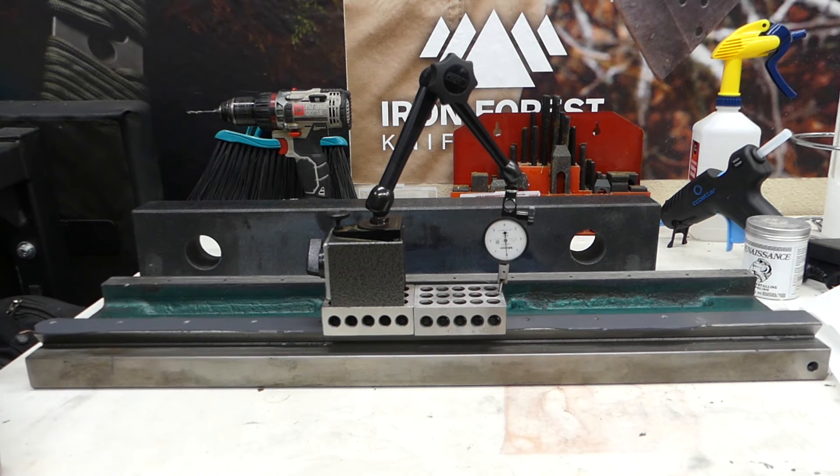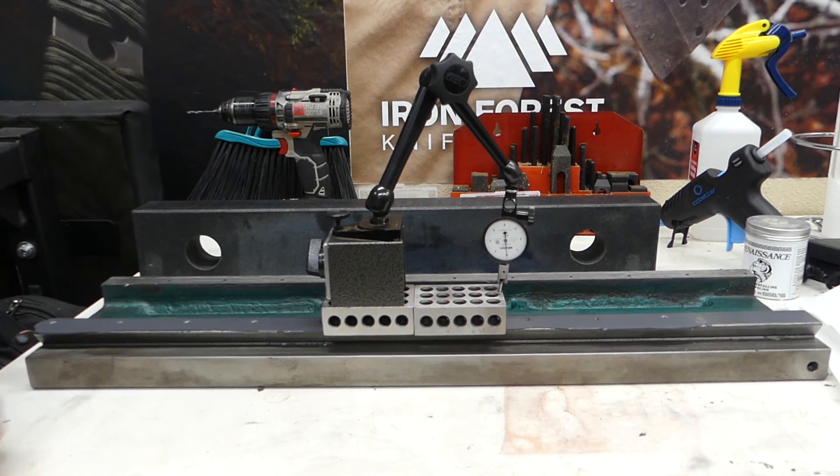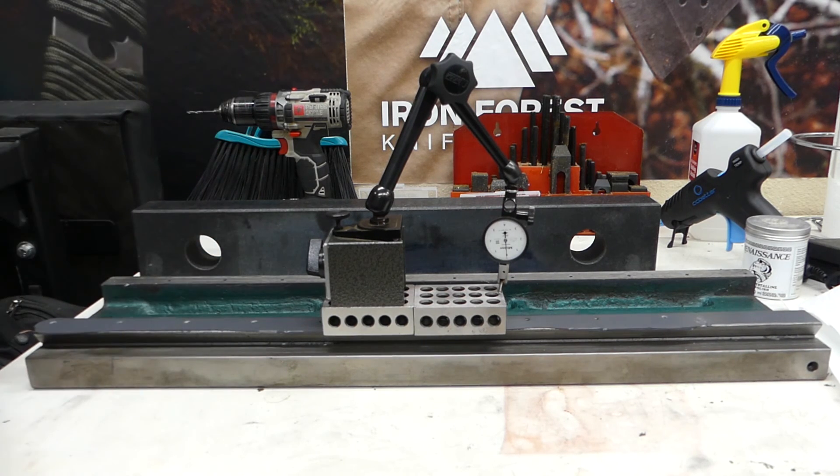I got some pretty good results pretty easily. The second side should be even better once I get the plastic laminate backing instead of wax paper. I think this is a really economical and easy way to cast a surface to mount your linear rails to. Most people are going to need a granite straight edge anyway to mount rails and get them dialed in, so it's really just taking full advantage of the tool's accuracy. If you guys like this video, give it a thumbs up. Subscribe if you want to follow this series, and put any questions or comments down below. Thanks for watching!